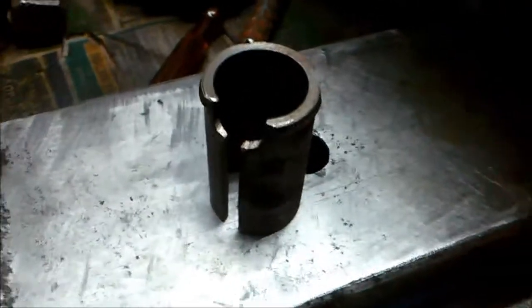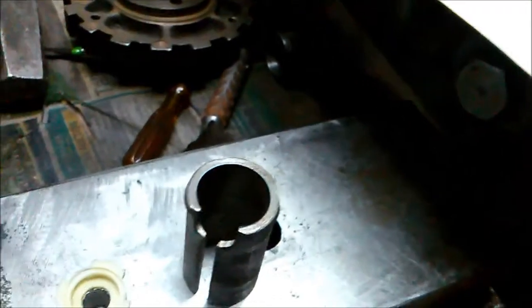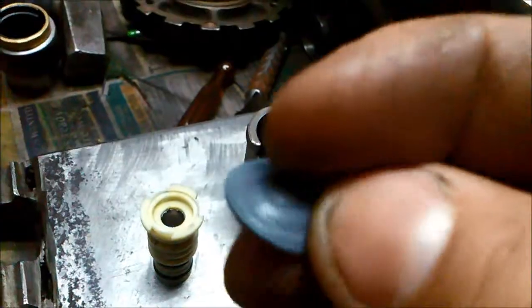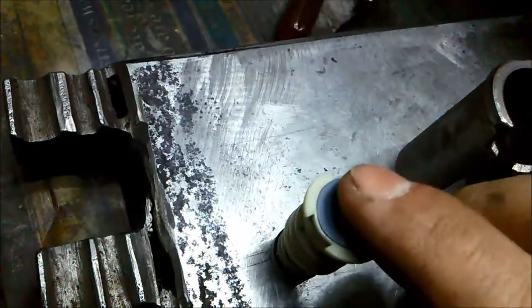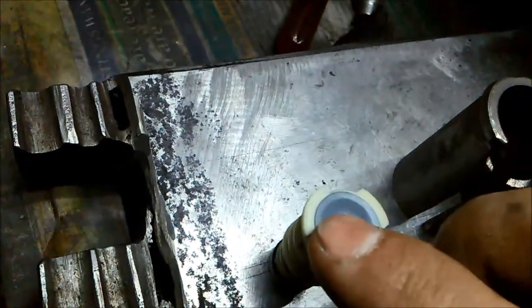Now using this tool here just to hold the plastic manifold, we make sure we've got a new diaphragm rubber — the other one has got a rip in it. You'll see there's a little step here. You just have to make sure that the O-ring diaphragm sits nicely, then you just tap it around with your finger so you'll feel it pop in.